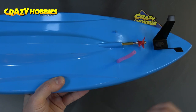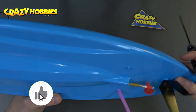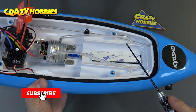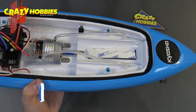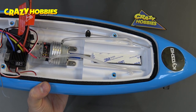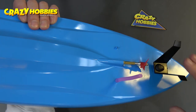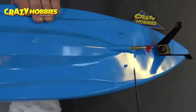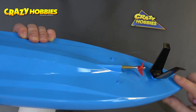Go buy a syringe, pump it with fresh water, stick the syringe in here. It will pump the water through and then spit it out. Do it about 3-4 times to clean the lines out for salty water. If you haven't got a syringe, just get the hose, stick it in there and go for gold. So that's the first thing.